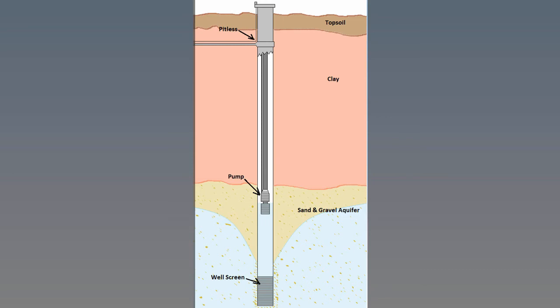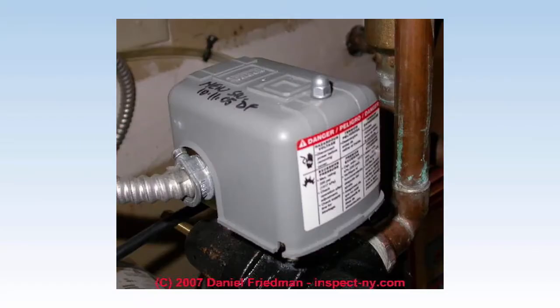What's worse, because the pressure in the pressure tank is still below the cutoff pressure, the pump will continue to try to run. A low pressure cutoff switch recognizes that the pressure has dropped below normal operating pressure, so something must be wrong, and it automatically shuts off the pump. The pump can't start again until a manual control is changed. Typically these switches are set to 10 psi, where normal operating pressures are 30 to 60 psi. Most systems probably don't have a pressure cutoff switch, but if you have a low yield well, it could save your pump if a hose is left on or some other high-volume water use lowers the water level in your well.